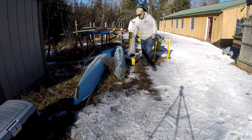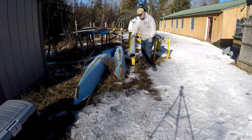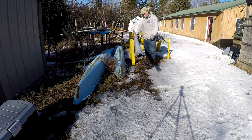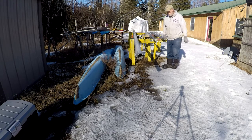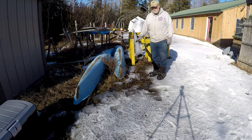It's taken me the better part of an afternoon to get all the hardware stripped off this mast, but I finally got every bit of it, even including that pesky cleat way down at the bottom. In a couple of cases I had to do a little drilling — everything was stubborn and needed a little tapping, a little heat, a little Liquid Wrench — but eventually I got it all out. I'll go over it with a little paint thinner to clean off the Liquid Wrench, and when the weather warms up I'll go ahead and do the paint stripper. Now it's just wash, rinse, repeat on the boom and the whisker pole. I won't bother filming that since it's pretty much the same process, but when I get to the paint stripper I'll videotape that to show you.